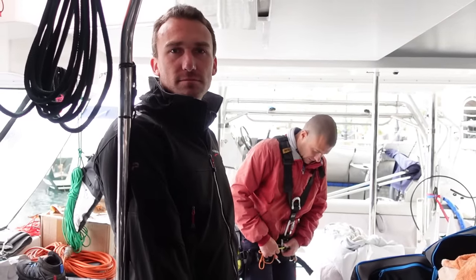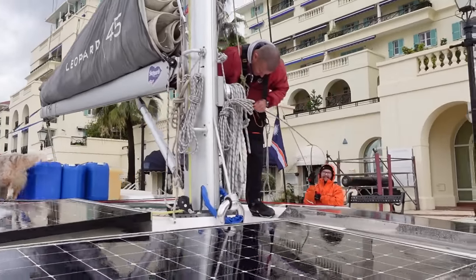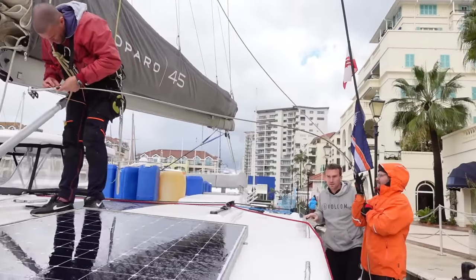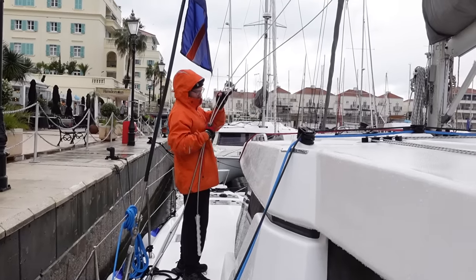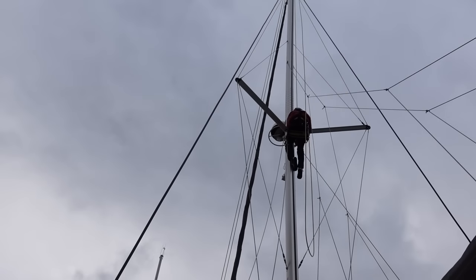And that's it. As you can see behind me, Trent's up at the helm, and that's because he's going to lift Guillaume up the mast and he's going to replace the shroud and then also check the rest of our rigging, just to see if there are any other issues, as well as the actual mast itself. Note here that Jean Gui has safety lines attached to himself for whatever he's working with, including his tools, just in case something is dropped. It obviously then can't fall down to the deck, which is important if you're ever working on your own rigging.